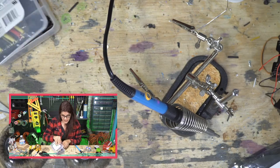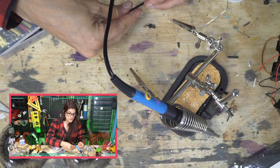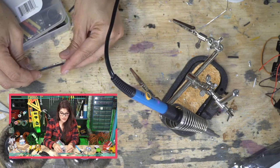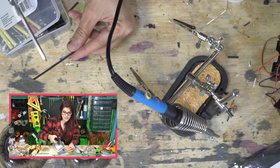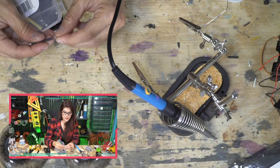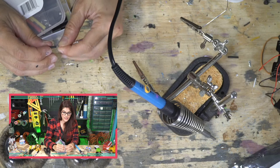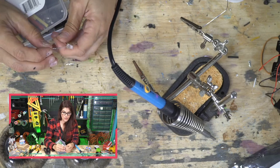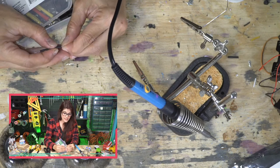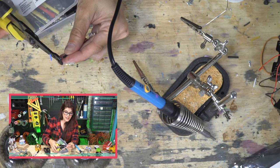Let's grab a little heat shrink tubing here. And I'm just going to measure. This will fit over the resistor. To make it even easier to know where my resistor is, I'm going to cut this right at the resistor, so the resistor can be like peekaboo. And just slipping that on. I chose a rather tight one, but I'm committed. I've chosen it. Now it'll go. The other thing is, sometimes I'm way too fast putting these on, and then the connection is still a little warm and your heat shrink starts to shrink the way it's supposed to, and then you can't get it on.